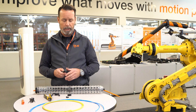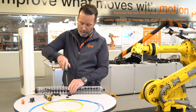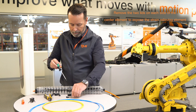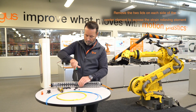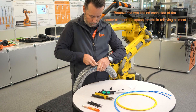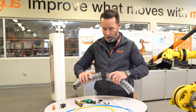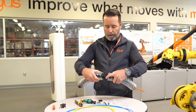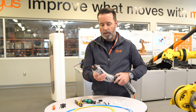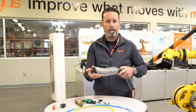The first step to installing a cable is to remove the two lids on each side from the center element to expose the strain relief element in the center. As we look closer at the center drive element, you'll notice that there is a two-sided strain relief on each side. TRX, just like Triflex, is a two-sided product, so you have two chambers — one on the top, one on the bottom.